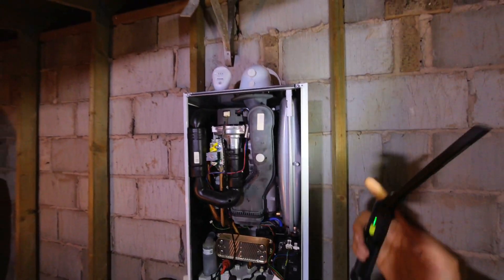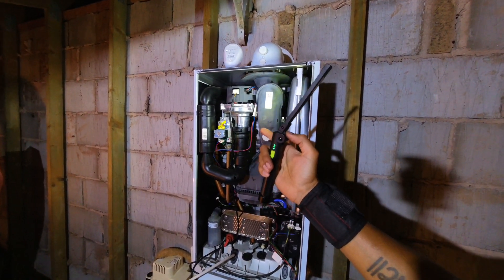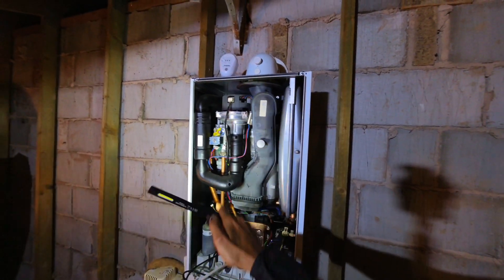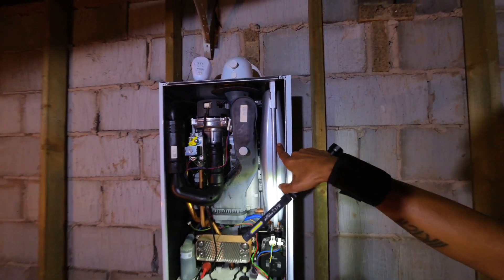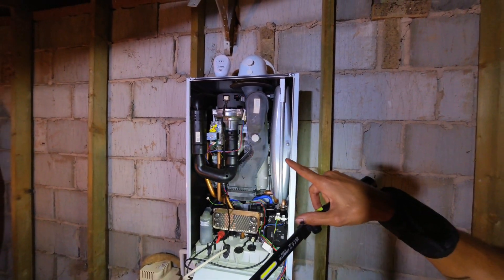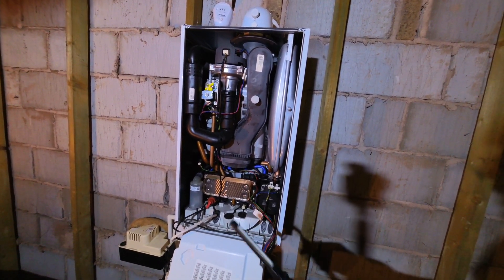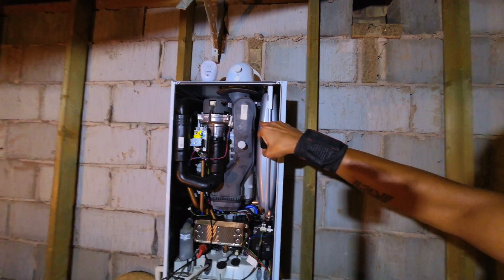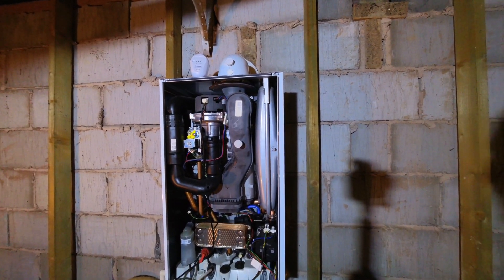There are no signs of anything spilling on there. Next I'm going to get the flue manifold off and get the fan assembly out. I've done a tightness test already which is all good. I'm going to disconnect the gas valve, take the side panels off, and remove the expansion vessel. I'll drain the boiler out first and do my wet test — check the pressure sensors are okay by draining it down, then take the expansion vessel out, which will make it much easier to get to the ten-millimetre nuts at the back.